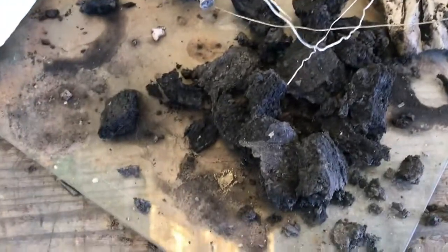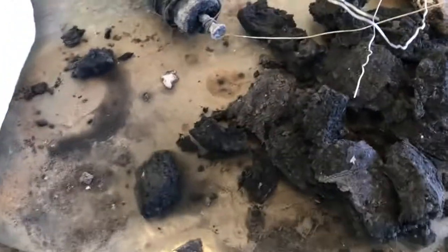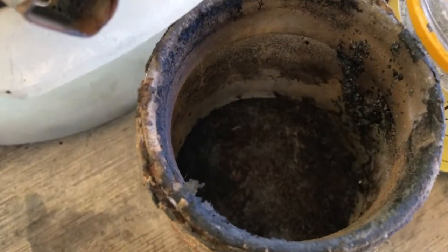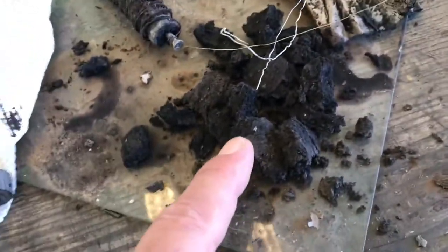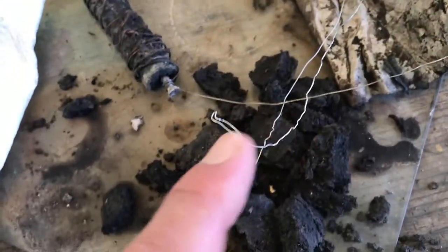Right, so after 30 charges on the round cylinder cells, both of them, there's the remainder of one, and that's the feather carbon version. And that's the carbon which flaked off for some reason every charge, where the original one didn't do that. And that's the reason for the failing of the cell. The center electrode held up, and it's still conductive, but this one, the wiring was going loose.